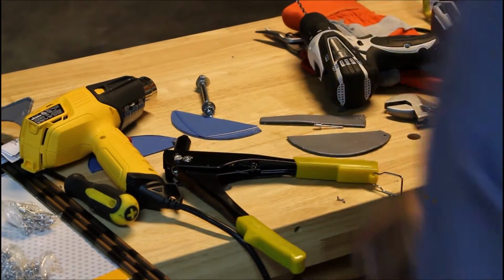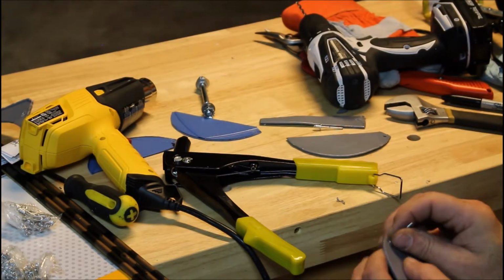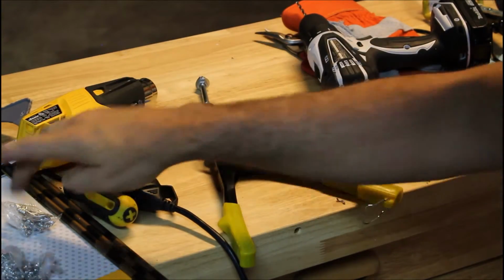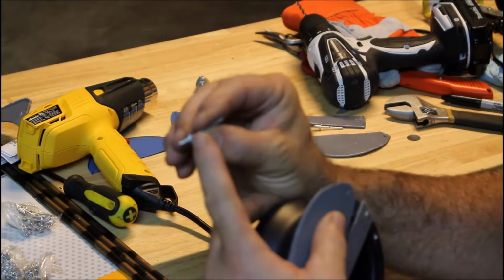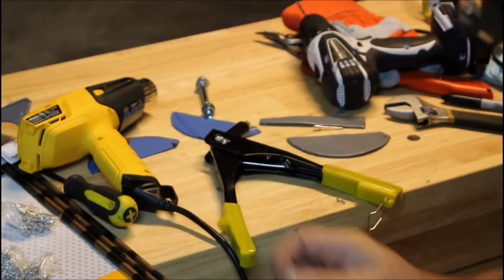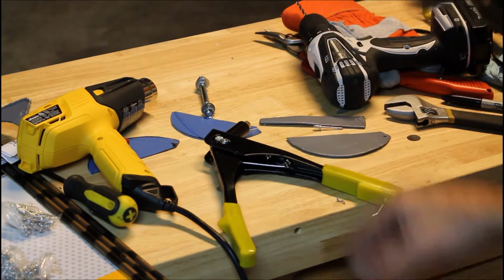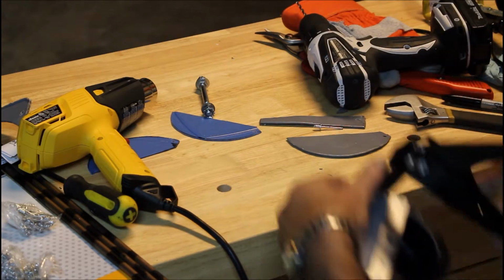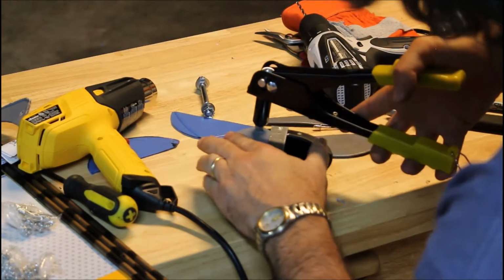Pop rivets are a beautiful thing. You never mess with them. You drill a hole, same size as the pop rivet. And this thing has different noses, or whatever they call them, for the different pop rivets. And you stick it all in the hole. What it does is it pulls this through and flattens this on this end, so you have a permanent fastener. That is the theory. So you stick this in here like that, and pull the rod back through the rivet.